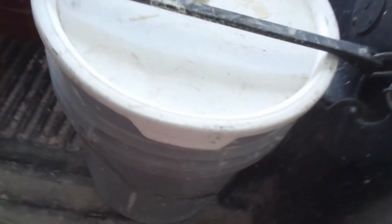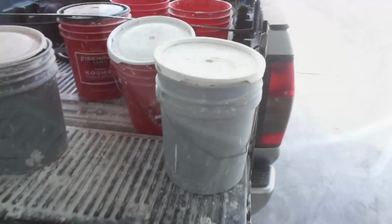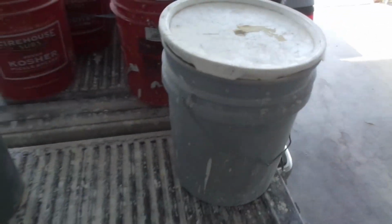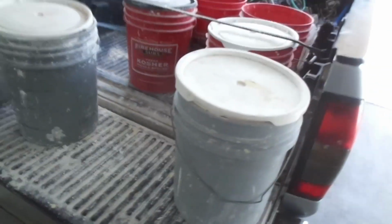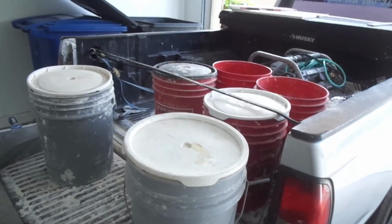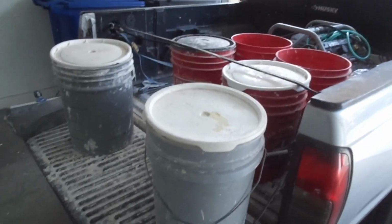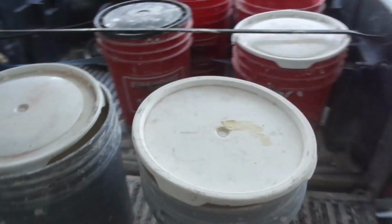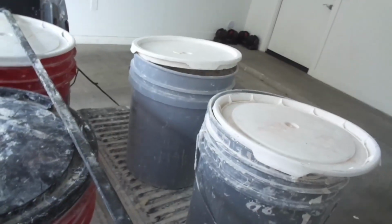So this is my joint compound. That's my 5-minute. I keep my 5-minute mud in a bucket. How do I know which bucket it is? Well, I only use 5-minute muds for these repairs. I don't carry around 20, 40, 90, all those different ones. I just have for repair work 5-minute mud because it's good stuff. It's awesome. You'll see in my videos the type of product they use. Depending on your region, you might have one or the other.